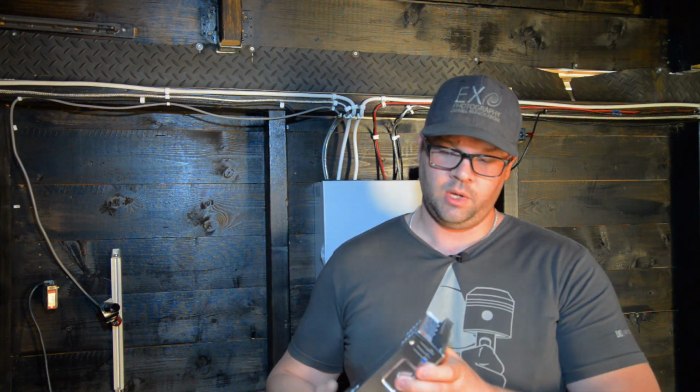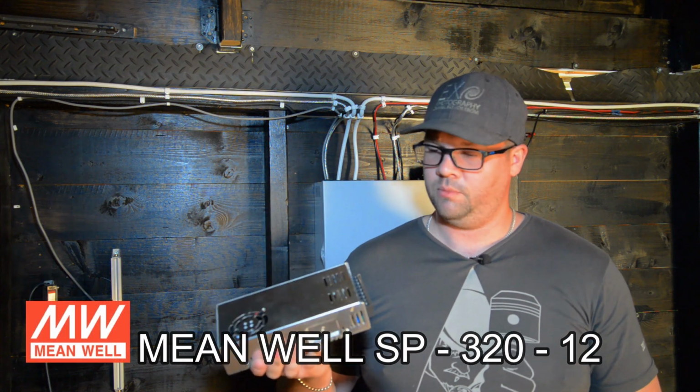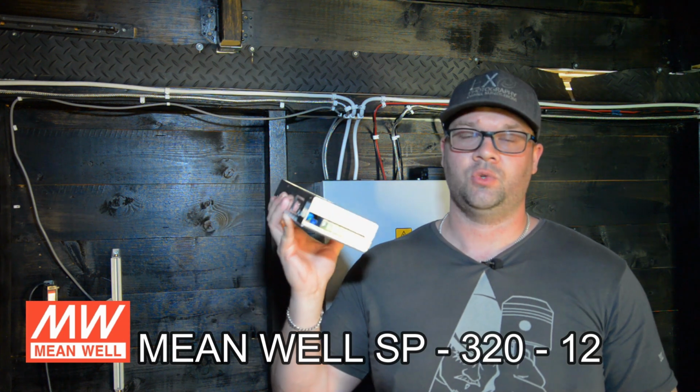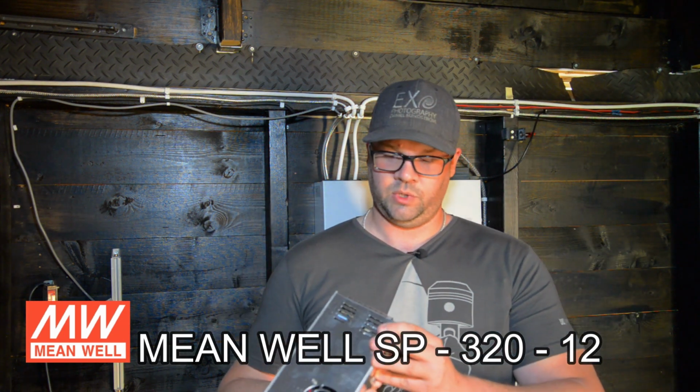Today I am going to change the power supply unit for my mount, my camera, basically everything that runs on the 12 volt system. The power supply I have been using up until now is rated at 13.5 volts at 17 or 20 amps. The one I am going for is the Meanwell series. This particular one is the SP320-12. So it's 25 amps, 320 watts.